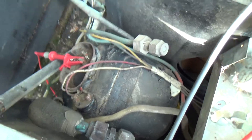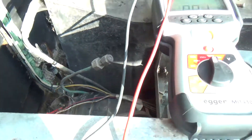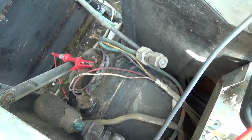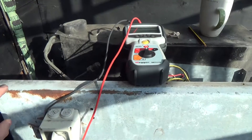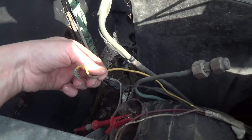Compressor is short to earth — that ties in with what we found. I put my amp probe on the overloads first just to see what they were tripping at and it pulled 80 amps. This thing probably doesn't even run at 8; it's probably 4 or 5 amps. I expect these places only got 100 amp supply anyway, so 80 amps down a 1.5mm cable.